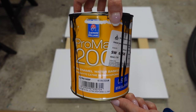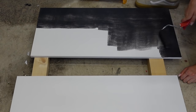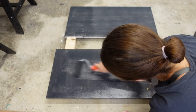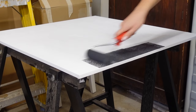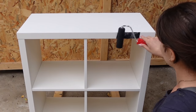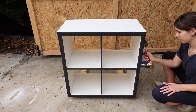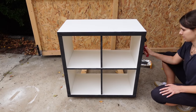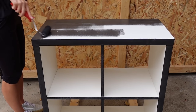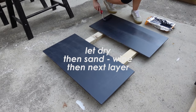For paint I'm using the Sherwin-Williams Tricorn Black in satin finish. I painted both sides of the panel doors using a foam roller, but since I'm not painting the interior there was no reason to paint both sides of the back panel — I only painted one side and left the other with white primer. I applied a total of three layers both on the panels and the Kallax unit, which I find is always the case with dark colors, and I sanded between coats for a smoother finish.